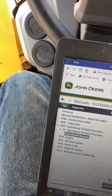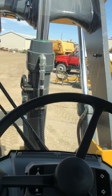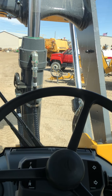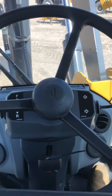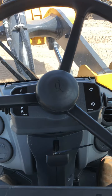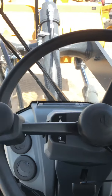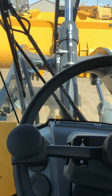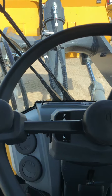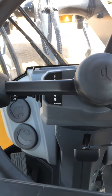Control check. Raise boom all the way up, hold it over relief for two seconds — one, two. Then go back down to eye level. Then enable it. It's supposed to raise about 30 millimeters, which it just did. Then push it again in automatic mode.